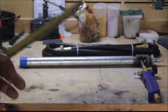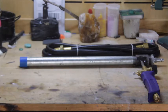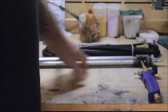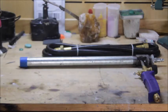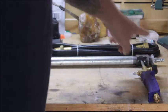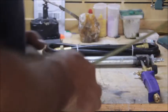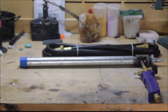After you get this piece of pipe, you're going to get a coupling that'll screw onto this pipe. Just go down to the hardware store, Lowe's, or Home Depot and get a one-inch outside diameter pipe, a coupling, and a reducer fitting that screws into the coupling. The reducer goes down to a quarter-inch thread, and you just thread your air chuck right into that reducer — and that is it. That's all there is to building this burner.